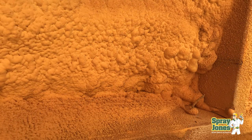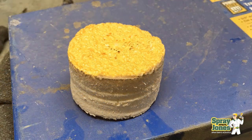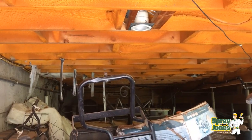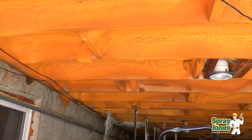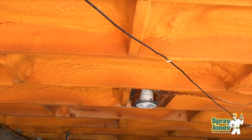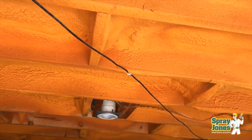The foam appears to be well adhered. It's on ratio from what we can tell, and we gave it a quick pull check with our device to see if it had debonded in any areas — and it had not. It was holding up fairly well, although we could get one area to pop off with a little bit of effort, but if it passes the pull test initially we're good to go.